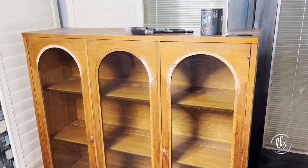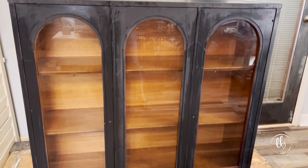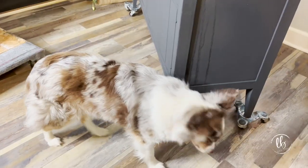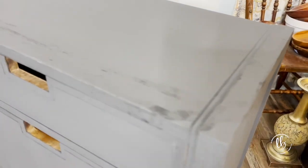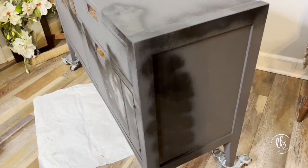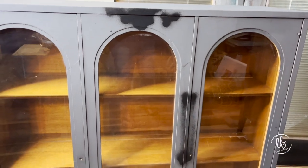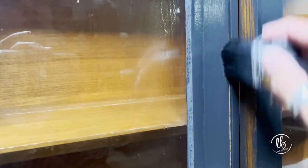Next, we can paint. I'm going to be using DIY Paint's Black Velvet — it's one of my favorite blacks. And that's what it looks like after the first coat. You can see that it dries a lot lighter. Then I had a lot of bleed-through coming through, so I went ahead and sprayed it with clear shellac. Clear shellac is great — it works great with DIY paint, it dries in 10 minutes, you should do two coats. Then I applied my second coat.